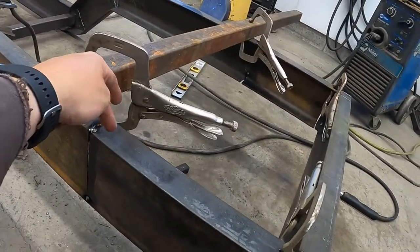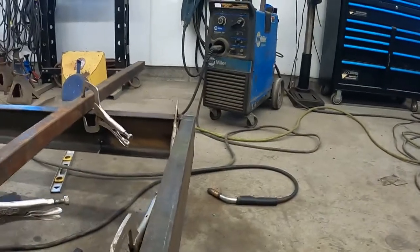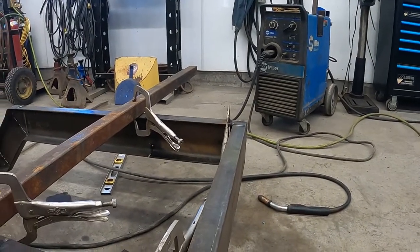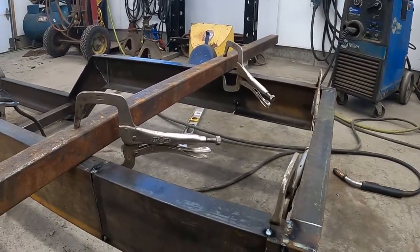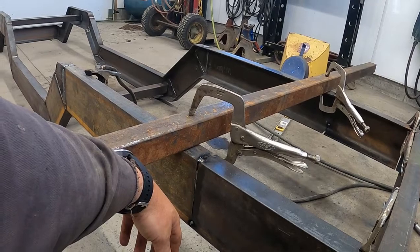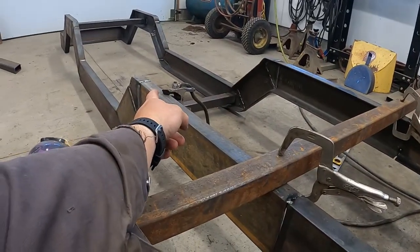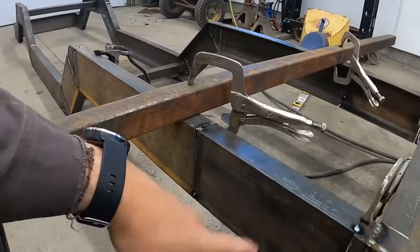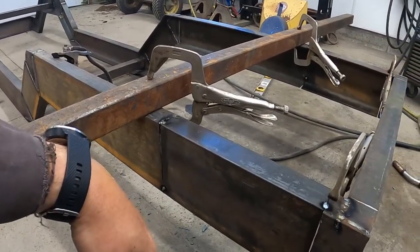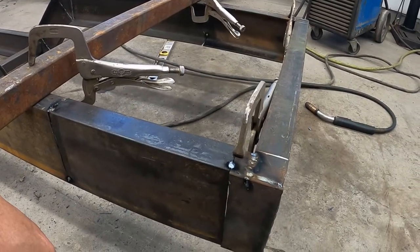So I made sure that here was 30, and then I'm going to have a small overlay on both sides, which the welds will go in there nice anyways. You'll hardly even see it. I might gusset these just because the motor's going to hang really far back there. It won't be much up here anyways, but this is probably strong enough. But get that all welded in solid.